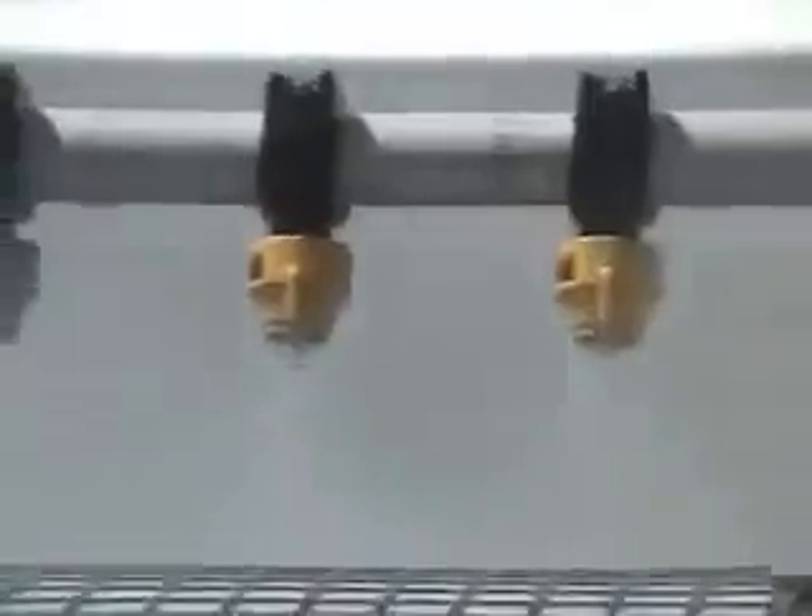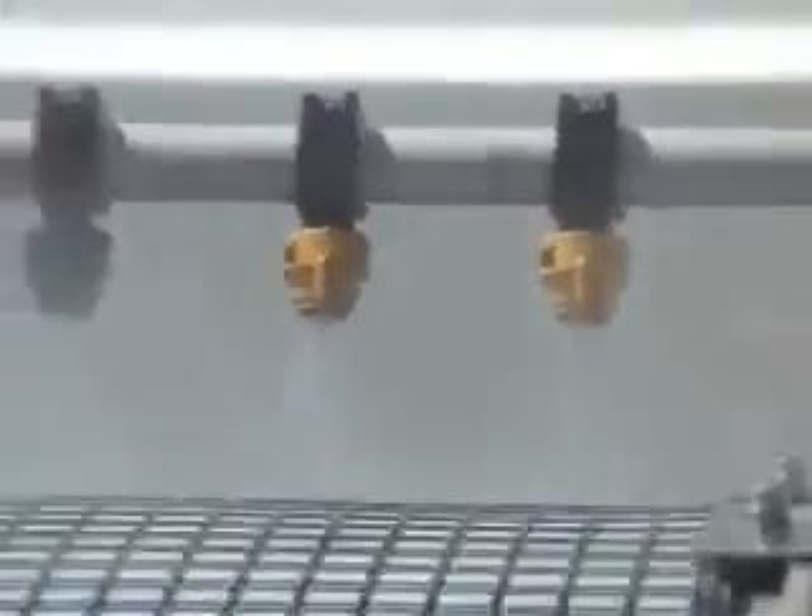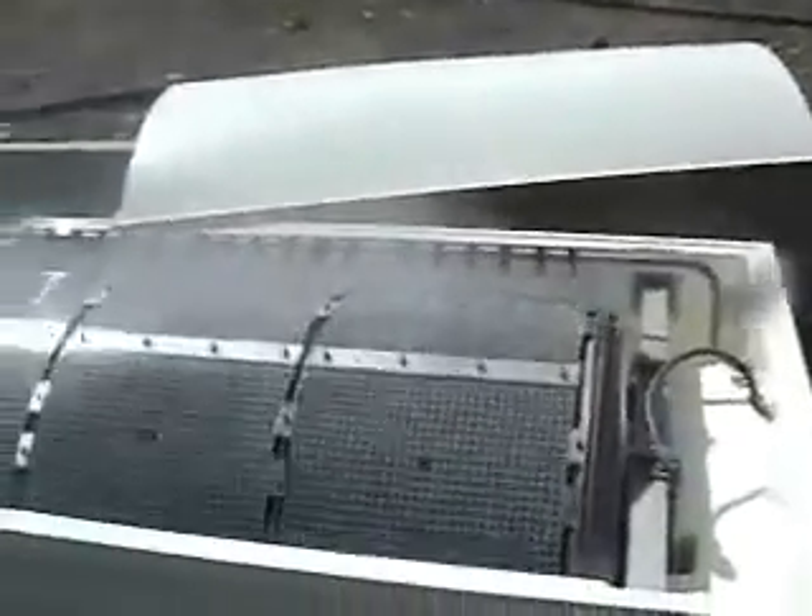As the screens are rotating, the backwash system turns on. This sends pressurized water at approximately 90 psi through the spray jets. These jets clean the screens and thus lower the water level inside the drum.